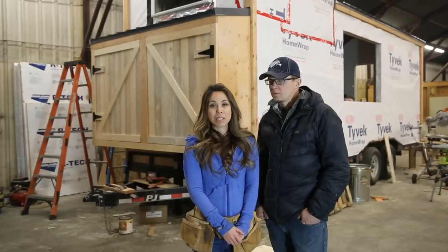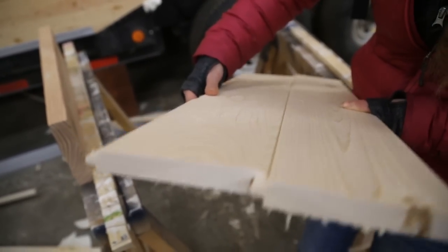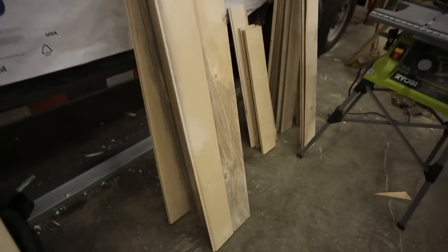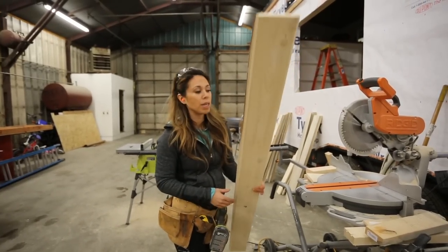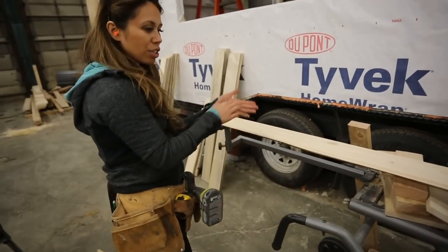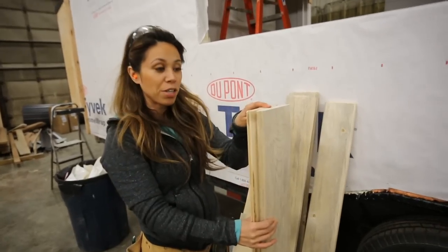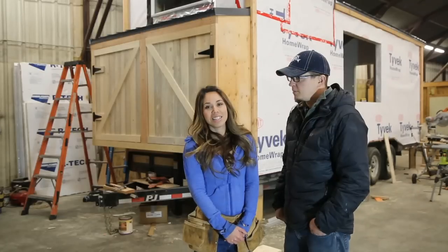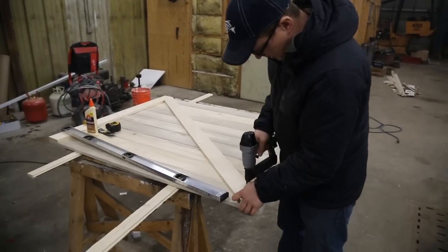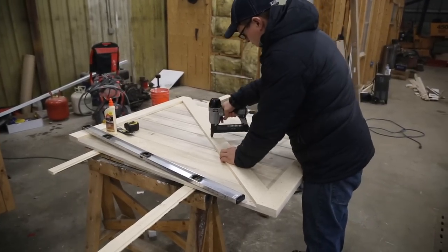For the doors, I really wanted a wood look to bring that wood element in with the siding. So we used leftover tongue-and-groove from the interior of the tiny house, and cut nine pieces to the inside length of the door area minus half an inch — 18 total. I set a stop on my miter saw so I could just butt each piece up and get a perfect cut without measuring. It looks really nice on the outside, and then we added cross-bracing on the front, glued on and secured with quarter-inch crown staples at inch-and-a-quarter.